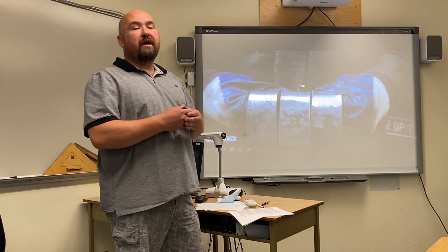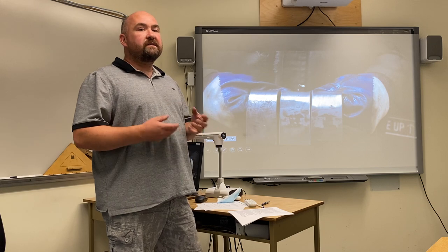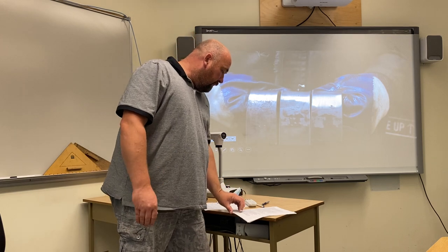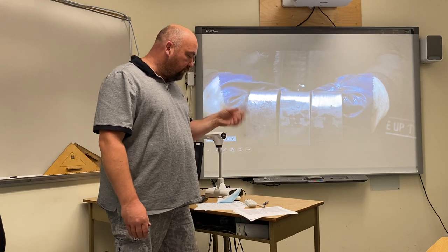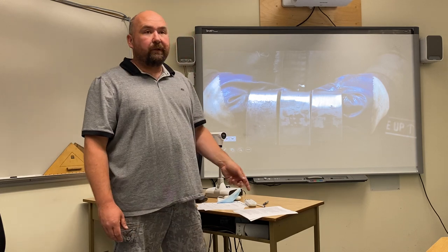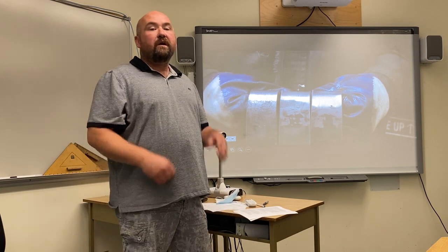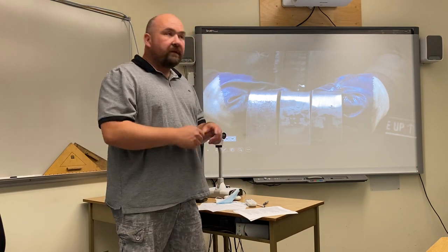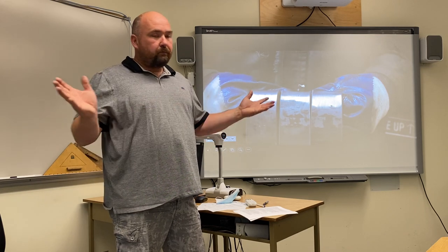That is what we're trying to achieve — you want to have a flawless weld. Having a flaw is not the end of the world; there are allowances in the code for what flaws are permitted. Tack only on the perimeters of the plate. No chipping hammer marks or stray arc marks on the plate — I don't want to see you beating on the plate with your chipping hammer. You should just be able to rake the flux off and it should pop right off. If you have stray arc strikes on the plate, it's an automatic failure.